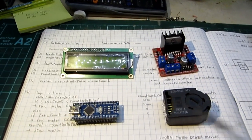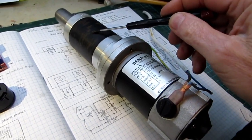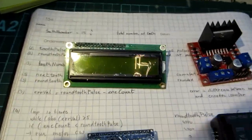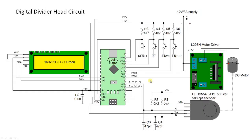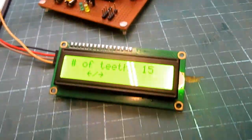Here you see the key components of the digital divider: an Arduino Nano, an L298N motor driver, a 24 volt DC motor with the large gear reduction box, a 500 pulse per turn encoder which is mounted on the motor shaft, and a 16 character 2 row I2C controlled LCD display. The schematic is shown below. The Arduino Nano drives the L298N motor driver via PWM signals. The Arduino also counts the pulses from the encoder mounted on the motor shaft. All information is shown on the LCD display and by means of push buttons you can select the parameters and enter the different menus. Here you can see the motor driver test setup, with an Arduino experimenter board connected to the motor driver and encoder, which I used to write and test the program.